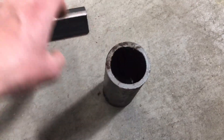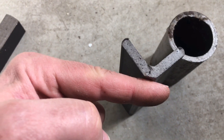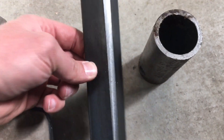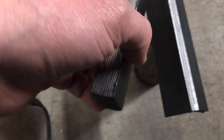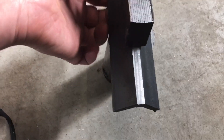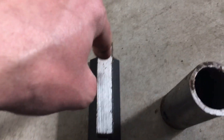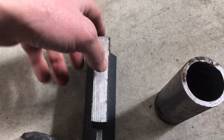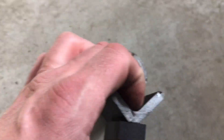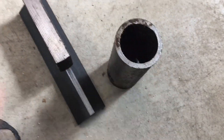The solution I've come up with is to build a little jig. I have a piece of angle and I've already milled a flat spot along the peak of the angle. The idea is to take this big chunk of three-quarter inch flat bar, put it onto that flat, clamp it, and weld it. Then drill it nice and square so it's not off on any axis, and use this as a jig so that when I clamp it to the pipe it will keep my drill aligned and give us a nice square and true hole.